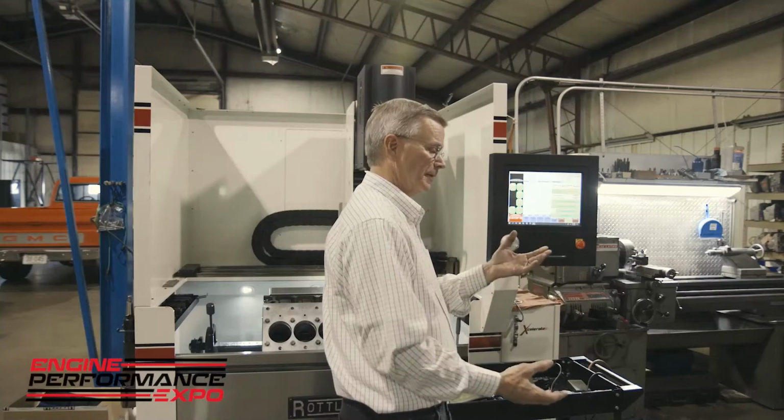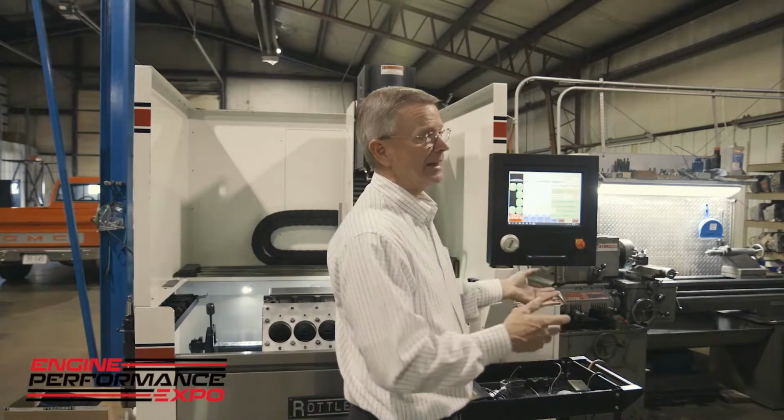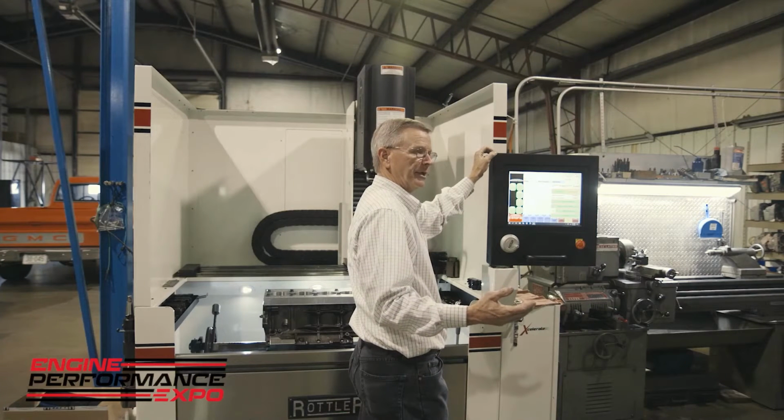So now what we'll do is we'll go in with our 600 grit CBN for a number of strokes at a prescribed pressure, and we'll see where we end up. And this is what we can vary. Depending on the RVK that we need, we can up the strokes or reduce the strokes. So it gives us the ability to adapt to the different surface finishes that we may need in a typical automotive machine shop. I'm going to explain as I go here a little bit.